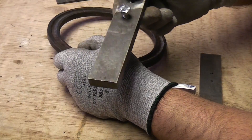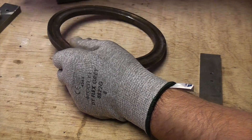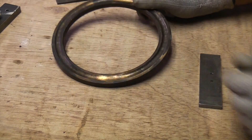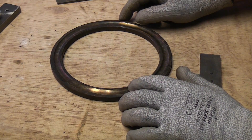If you wanted to drill the mild steel piece it would be relatively easy — you could just do it with an HSS or a cobalt drill bit. If you wanted to drill the hardened steel, you'd have a major problem on your hands. It would be extremely difficult; I'm not saying it's impossible, but it would be extremely difficult to drill hardened steel like that.